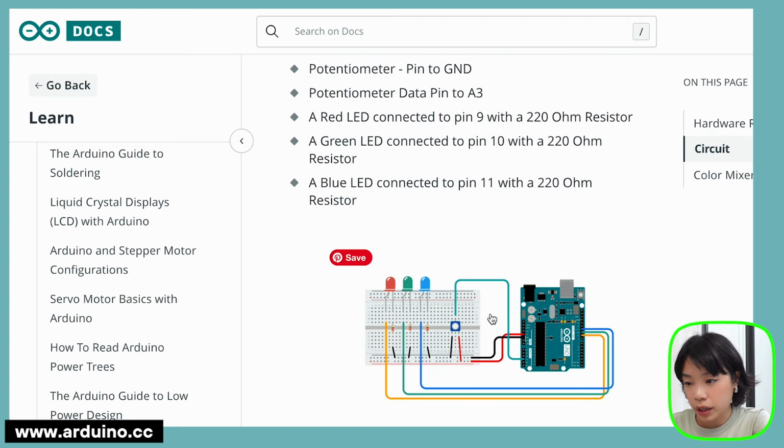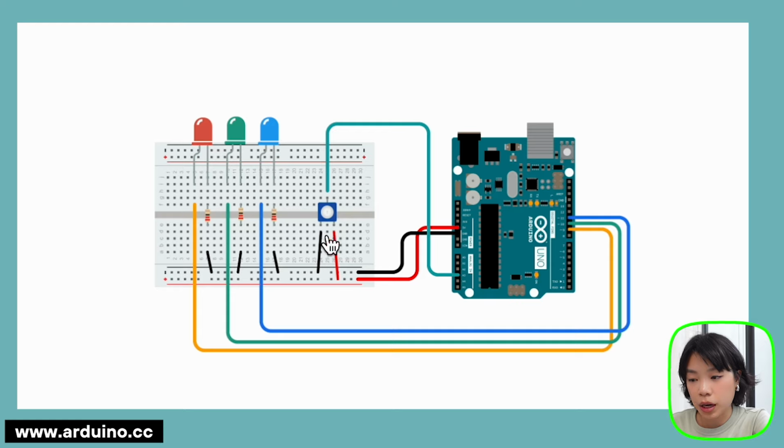So if you look at here, the potentiometer comes with 3 legs. One side is going to ground, the other side is going to power, 5 volts, and then the middle part goes to an analog pin, A3. So that's what we're going to do.